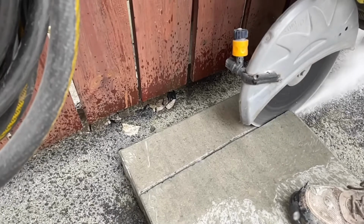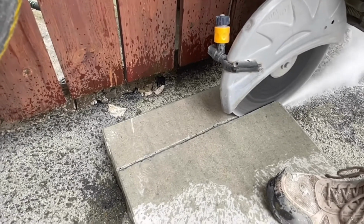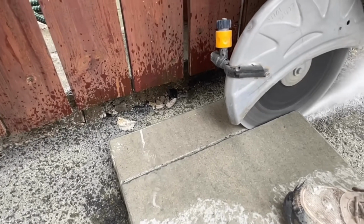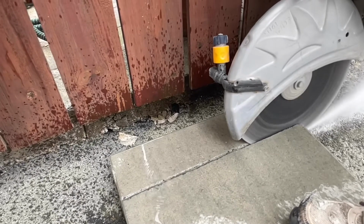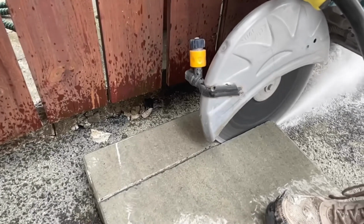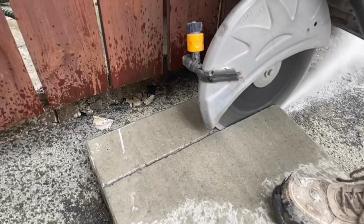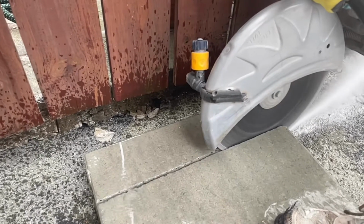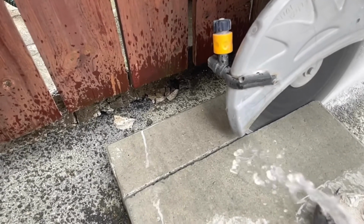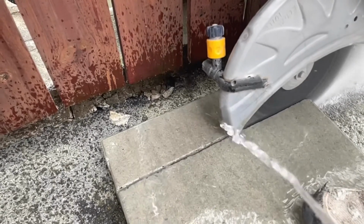So at the top of your paver, it looks even, and as it goes down to the bottom of that paver you're cutting, it curves in, so the bottom is technically not as wide as the top part. That way when you put the paver in, you're making sure that you're not leaving too much at the bottom where the blade is facing the opposite direction, because it will not really fit in correctly. It's probably not the end of the world, but in general, cut straight down or slightly in onto the piece you want to keep.